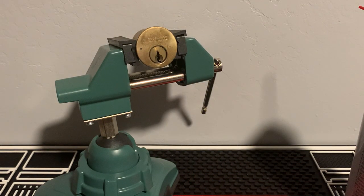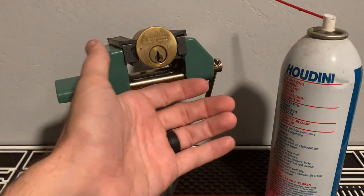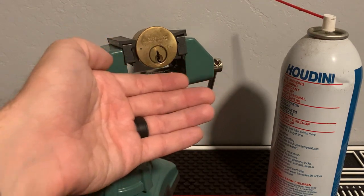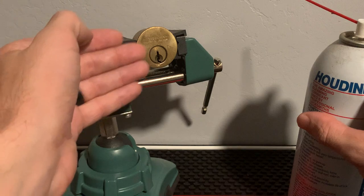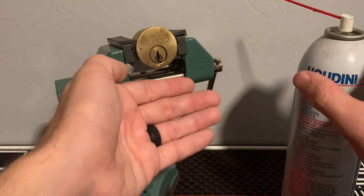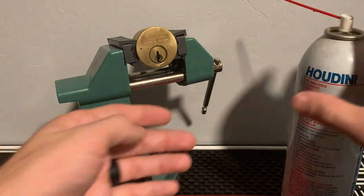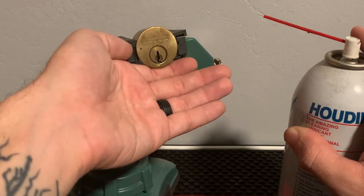For the cleaning of the lock cylinder, I highly recommend making sure you have a true lubricant and are not using WD-40. Go ahead and grab a paper towel or a rag and place it just underneath the lock, pressing it against the door. As you clean the cylinder, anything that's inside is going to come back out — it'll basically start spewing out all the gunk and goo. You don't want it to drip down and stain the door, carpet, or anything around you.